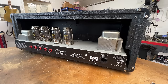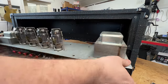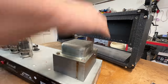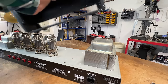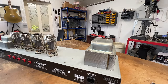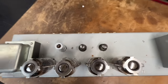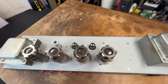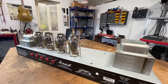Let's pull the chassis. There are just three preamp valves. One's going to be a phase inverter, so that means at most we've got four gain stages — which doesn't seem a lot for a high gain amp. There must be something else going on in there; I wonder if there's diode clipping or something similar.